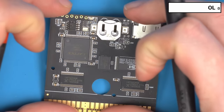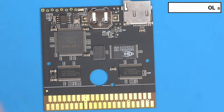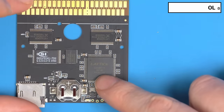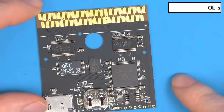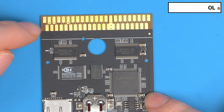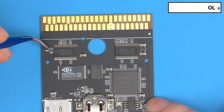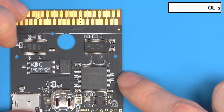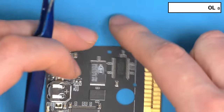It's an iCE40 — the same as what we use on the clean screen, funnily enough — so a nice high-quality FPGA. It's clearly driving directly, putting 3.3 volts onto the Game Gear pin. The slight concern is that 5 volts is technically being passed back up through this resistor and into the FPGA, which is not ideal and might eventually damage the chip.